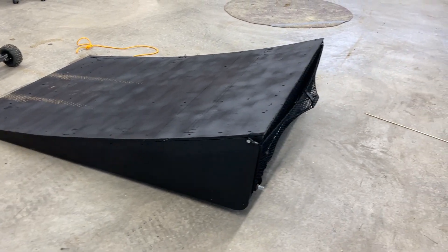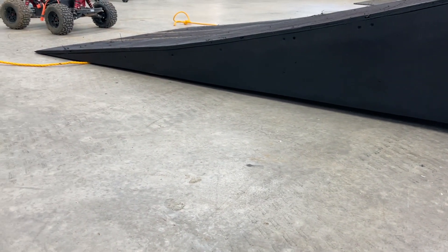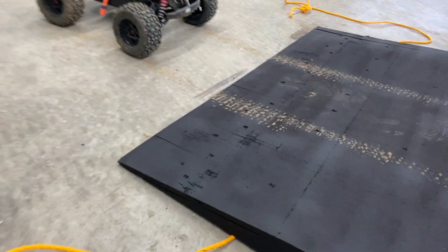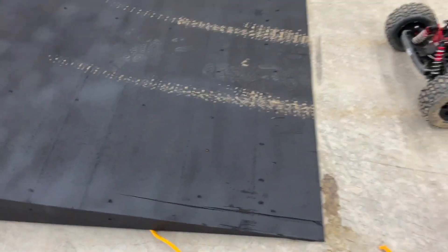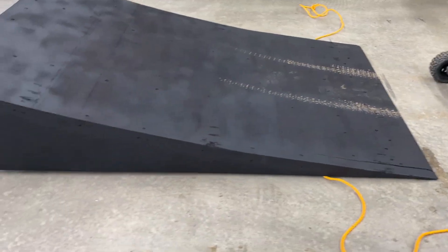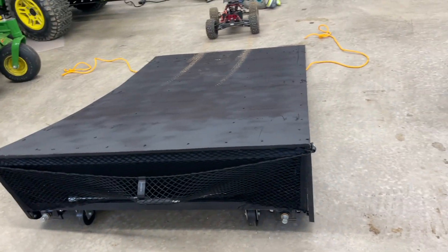I have treated wood on the base material down low. There's only one place that actually touches the ground — down at the very bottom — and that is treated wood as well. At this point, there's no part of this that's unsupported. Anything that will touch the ground is three-quarter treated plywood. I use one-by-three for cross supports every six inches. That's way overkill for the half inch plywood — totally unnecessary — but that's what I went with.